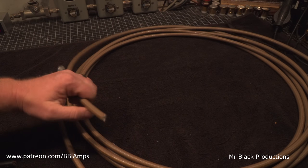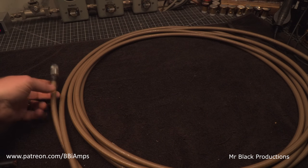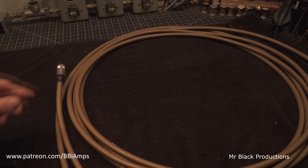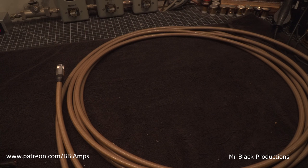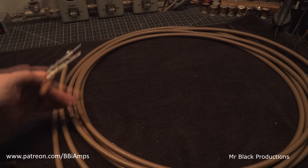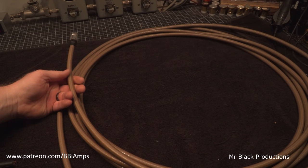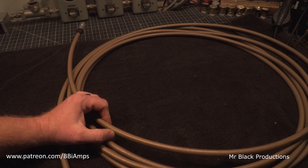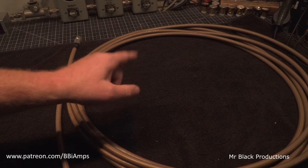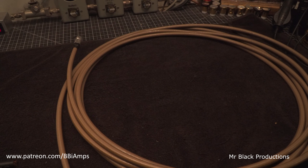This joint right where the connector meets the coax — the shoulder — I want to add a little bit of support to it because of where I'm putting it. When you see where this goes, you'll understand it's a little tight. So I'm going to spool off 12 and a half feet. I'll cut the jacket and leave myself about another eight inches to make the loop back that comes back to my puck. Eventually sometime next week in the part two of this video it'll be me installing this into my truck and putting some power through it — five to six thousand watts maybe to test it out.